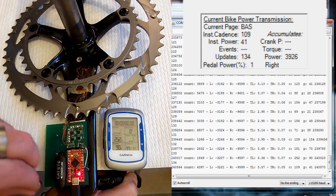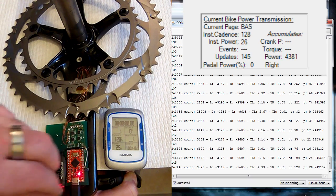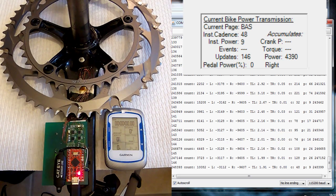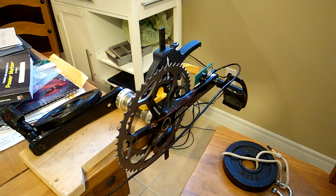If I speed it up the power goes up; if I slow it down it goes down. That should do as a good tabletop explanation. Let's do some calibrations to make sure this is correct and then we'll put it on the bike. Calibration is very critical — one of the things about these devices is that they tend to be very linear, but your zero point can theoretically shift a little bit. A small offset in either a positive or negative direction can have a minor offset in your watt readings, which a lot of people familiar with power meters already know.